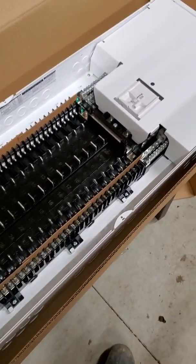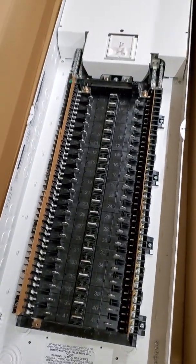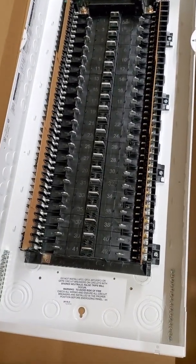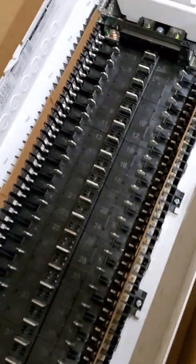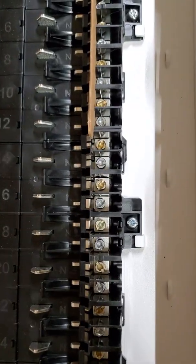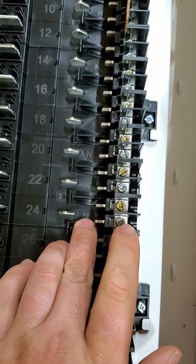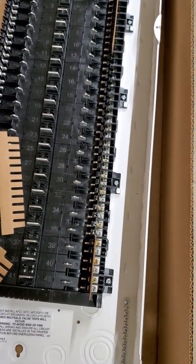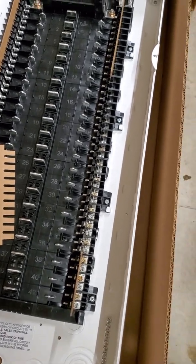So as you can see we're getting a look at the inside of the panel. This is a 200 amp 42 circuit panel — it looks way bigger than a 42, but remember we're full-space breakers only. Super cool feature: everything mounts to the panel, nothing mounts to the breakers, so the breakers are completely tool-less. You can see we've got a neutral screw and a hot screw for each breaker on the panel itself. So your arc faults, your GFIs, anything — even just a standard 15 or 20 amp breaker — just snaps in and you don't have any wires going to the breaker.